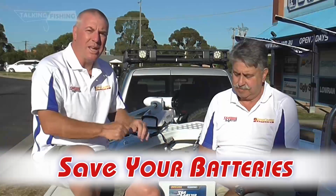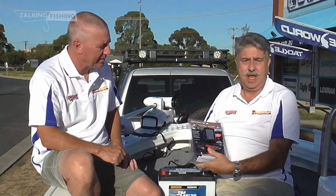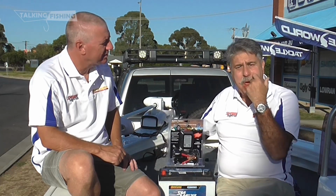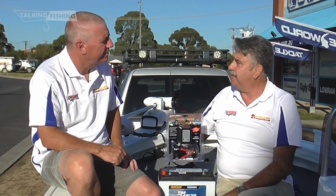So Michael, coming into winter, what should people do over the off season to make sure they've got a good battery for next season? Well, there's two ways we can do it. We can either disconnect the voltage going from the batteries to your electrical systems, and there's a couple of ways to do it. First way is what I've got in my system, an isolation switch. Now I'll just turn that to off and I'll put a trickle charger on it, such as this. And spasmodically that'll be used every month for about 12 hours. And my batteries are tip-top for the new season.